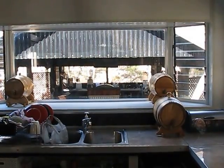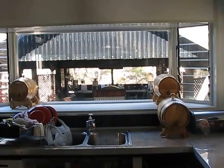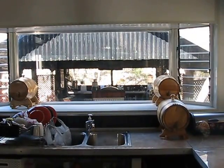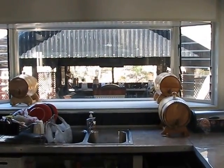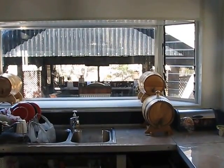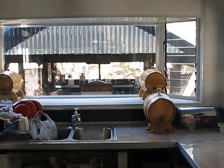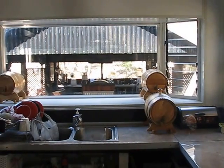This is a fairly square building. Sorry, it's about 10.5 metres by 10.5 metres on the main building. So because it's a rectangle, I didn't go for long heavy channels. If you're building narrower and longer, you could probably go to RHS or RSJ if you're really keen. A few more bucks involved, but all these C channels that I used was probably a little bit more support as far as blocks went underneath.